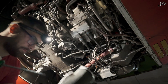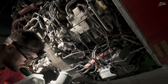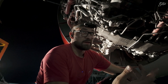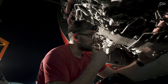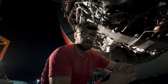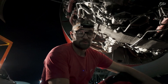Take a bigger screwdriver and we need to look between the ribs and look for metallic particles, rubber particles, and anything that can be a problem. What does it mean if you find metallic particles inside the filter? Well, it can be anything from the tanks all the way to the boost pumps which actually deliver the fuel to the engine. If you find a large amount of metallic particles, it really can be the boost pump and there you might have a problem — but that's a story for another time.